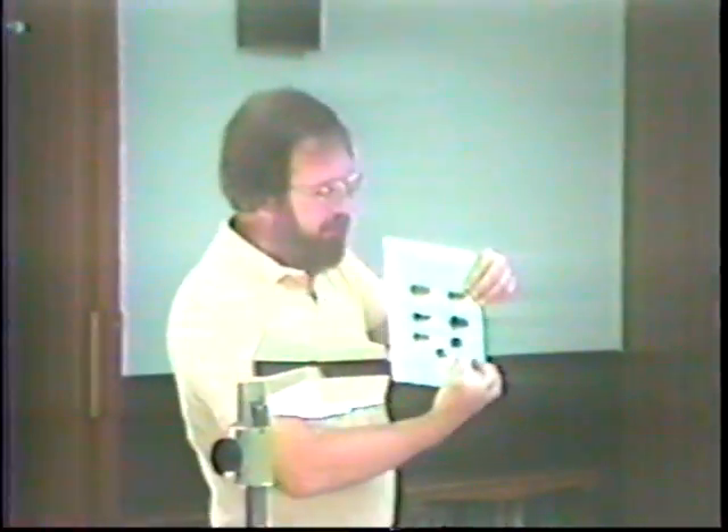Now we get to the real problem: paper capacitors. The ones with beeswax on them — if you're ever unsure whether a capacitor is paper, saw the ends off and crack the case away, and you can unroll it. These are the bad guys. There are also mica capacitors in radios — the rectangular wafer-like ones — they usually don't cause problems. But watch out for capacitors found in military radios that even say 'mica mold' on them but are paper inside. They're all bad.